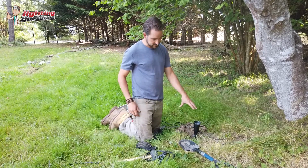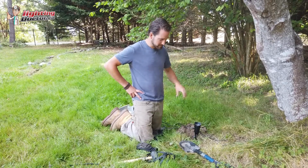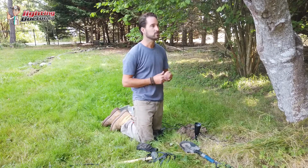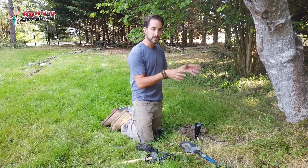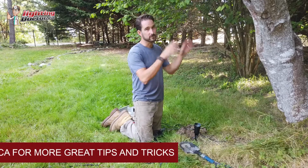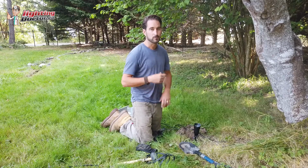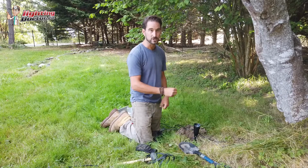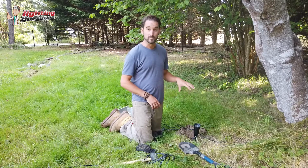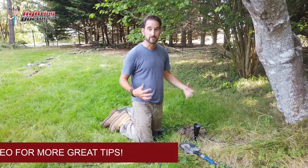And then the last thing I was going to mention, I totally forgot my train of thought, but the adjustment, oh yeah, and that's what it was, is a general rule of thumb: whenever you're installing up lights, you almost always want to have them more upright than you actually think. I see so many people angle them at the objects, and you typically get a lot better effect if you're angling it more upright than you think. So that's just a good general rule of thumb. But regardless, come back at night, make any adjustments, make sure you're getting the right effect. Even on a property this size, even with how many lights like these we've installed, I'm still coming back at night, and I want to make sure that I'm getting the effect that I look for with the design and everything that we've come up with.